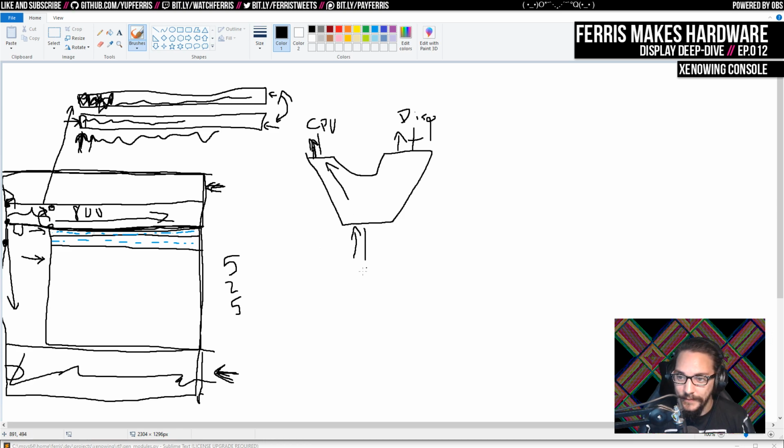So that way this bus gets interacted with the right way still, and then both of these just interact with respect to that busy signal that they have to worry about anyway, and we get this arbitration for very little logic. The only thing is that when we issue a read, we put that into the underlying bus, and then when we get data back, we need to know where that read came from, so that we can issue that data back to the right bus master here.